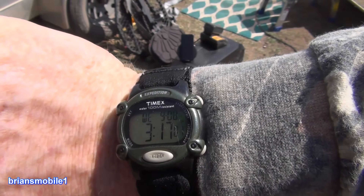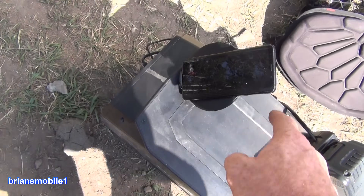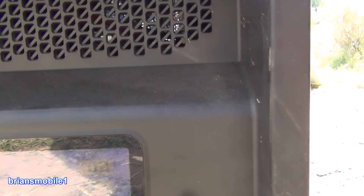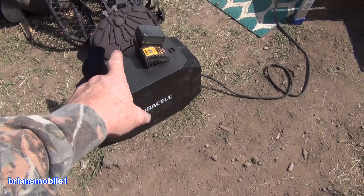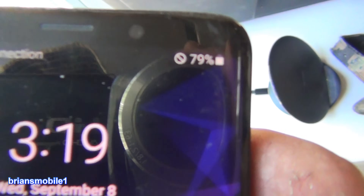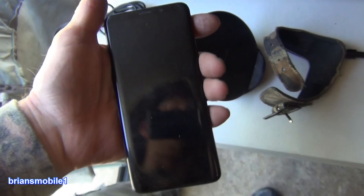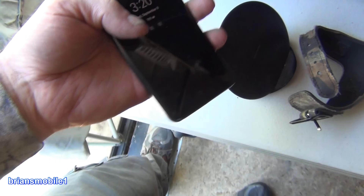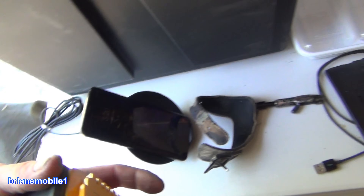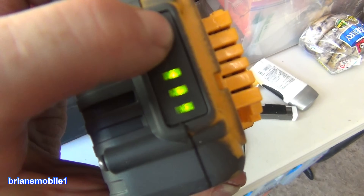It's been a little over 20 minutes. The battery pack charged, and we're back to 100% — that's actually decent. You can in fact run this at the same time you're doing solar. I don't know if it's bad for the AGM battery, but it can be done. However, it then shut off — come to find out it's not fully charged. I think if it gets too hot it shuts down, and it is hot. It's a good idea to have your battery in the shade while you have your solar panel in the sun. This other pack seems to have a better charge controller — it's got a fan in it and shows fully charged.